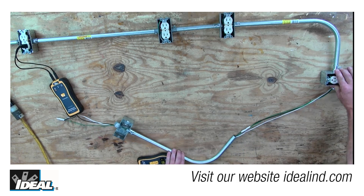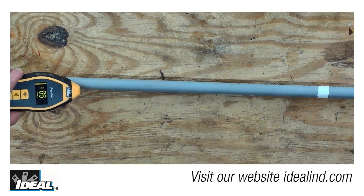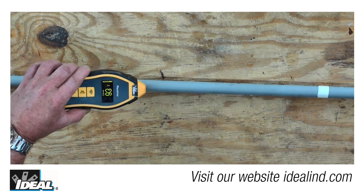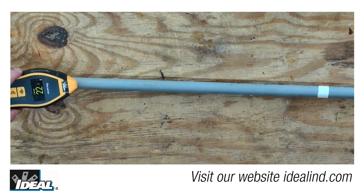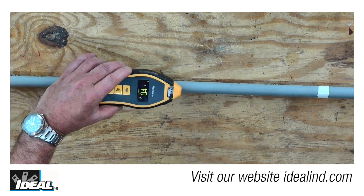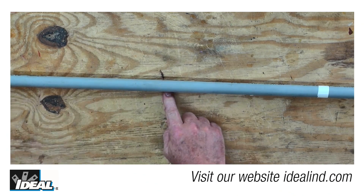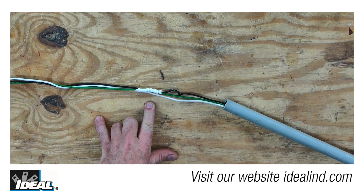When I do the same to box number five, you'll see the signal has dropped off dramatically, so I would suspect the short is somewhere in between these two boxes. If the wires are in PVC pipe or buried in the ground, continue following the highest reading until the signal starts weakening. This is the point of the fault, as the signal flows to ground instead of continuing strongly down the conductor. Reduce the sensitivity range and use the nose of the receiver to pinpoint the location of the fault.